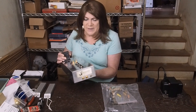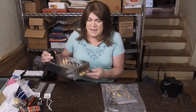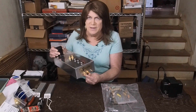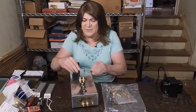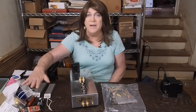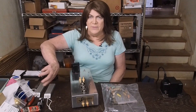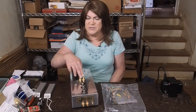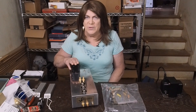This is a little one I built. It's in a 6x14 aluminum chassis. It's got RCA inputs here in the front from the turntable, and this is for the ground wire. The outputs are here on the top, and it's sitting right next to my amplifier — which is one of the reasons all my amps have the RCA inputs on the side, so I can run short interconnects from the phono stage over to the amplifier. The power transformer is in the back.